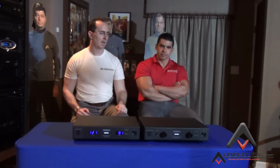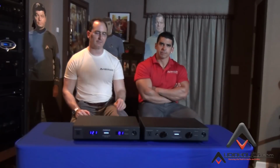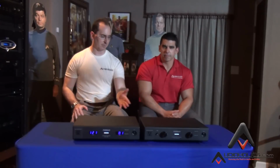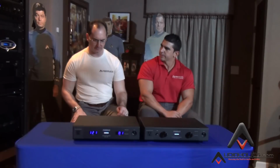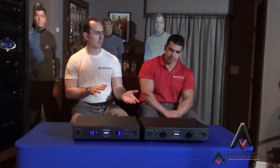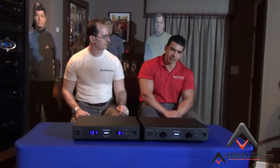And Furman is one of the companies. Panamax, their sister company, is another trusted company. So at the very minimum, you're buying these boxes, ensuring that you're protecting yourself from surge or lightning. There's also another feature that both of these units have, called under voltage, over voltage protection. If it drops below 85 or 80 volts, or if it goes above 140 volts, it'll shut the units down, because under voltage creates too much current draw from your equipment, and over voltage could damage capacitors.